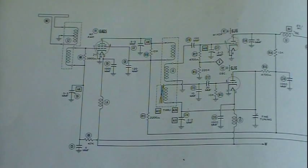And that tube can work very efficiently because it only has to deal with, and was designed in that circuit to only amplify, that IF frequency. And I can have several stages of amplification. Most radios that you'll run into have one or two. But there are receivers, expensive ones, top dollar ones that had several stages.